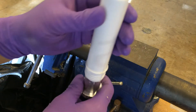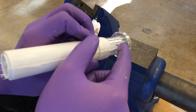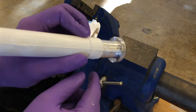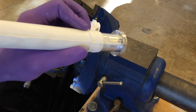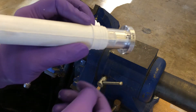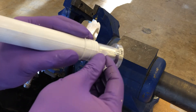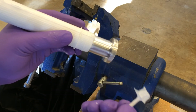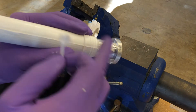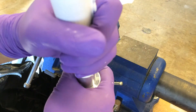I've got this core pin in here that I've got to get out. There's a little drip down here, and you might be tempted while it's wet to try to clean up that drip with a paper towel — resist the urge and don't do it. It's much easier to clean this off when it's a big mass; it comes off really easily. If you wipe it off, you won't be able to get it all with a paper towel and you'll leave small flecks that are hard to get off the surface. Much easier to let it set as a big mass — you can easily get the whole thing off. Now I've got to get the core pin out.